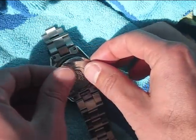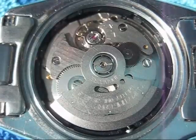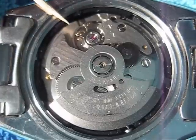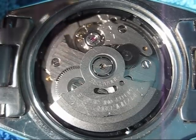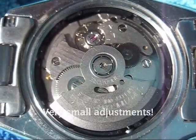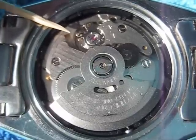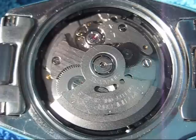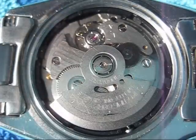You can open up the back of the watch to access the mechanism. I've got the back of the watch opened up now. This little bar right here — the one with the two dots on it — is the regulating bar. You can see the little plus and minus here. To speed up the watch, you take this bar and gently push it this way with a toothpick or a matchstick — that will speed up the watch. And if you push it clockwise, it will slow it down.